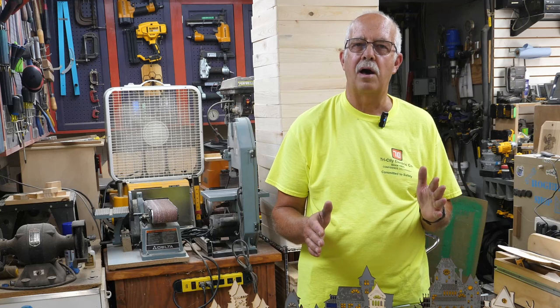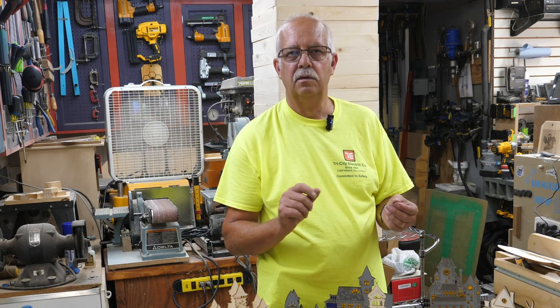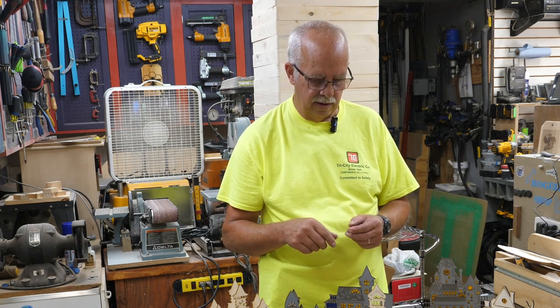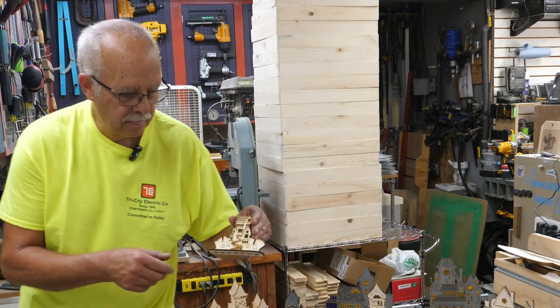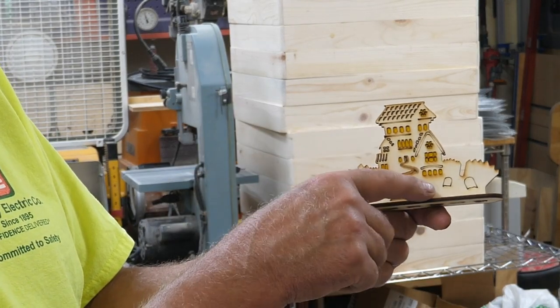And I have taken those designs, and as we go on the computer, I'll show you how I modified them to fit the way I wanted to do this. As they come, they're set for what they call a multi-layer or multi-cut and engrave all in one layer. I don't like to do that. I like to split my things up, and I like to change things around and maybe cut certain things out and not others, and maybe infill this or not infill that, or maybe just make a line engrave. For example, this one here has a combination of cutouts, line engraves, and infill.